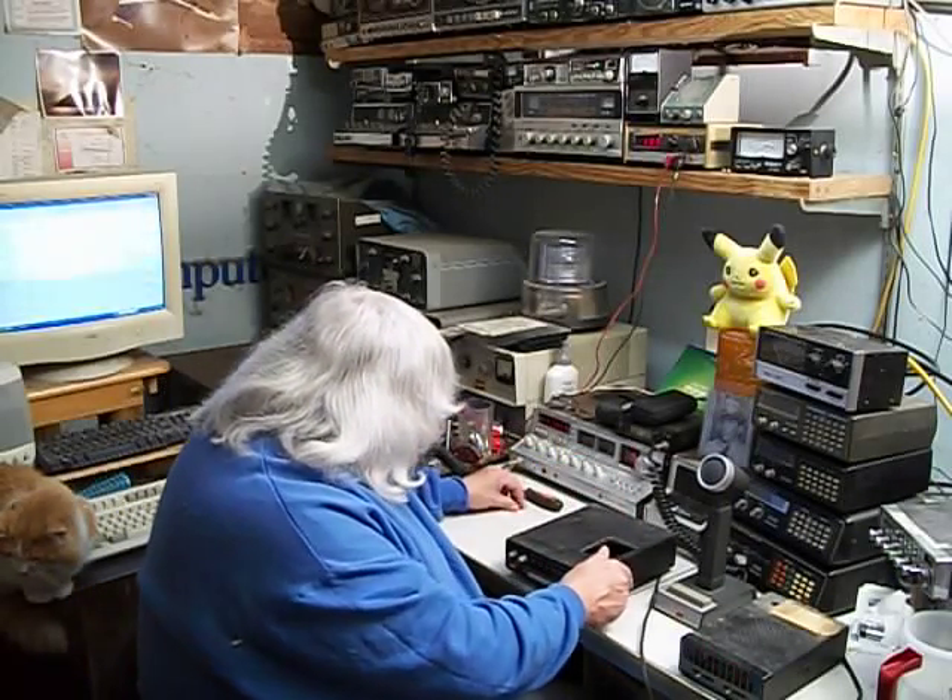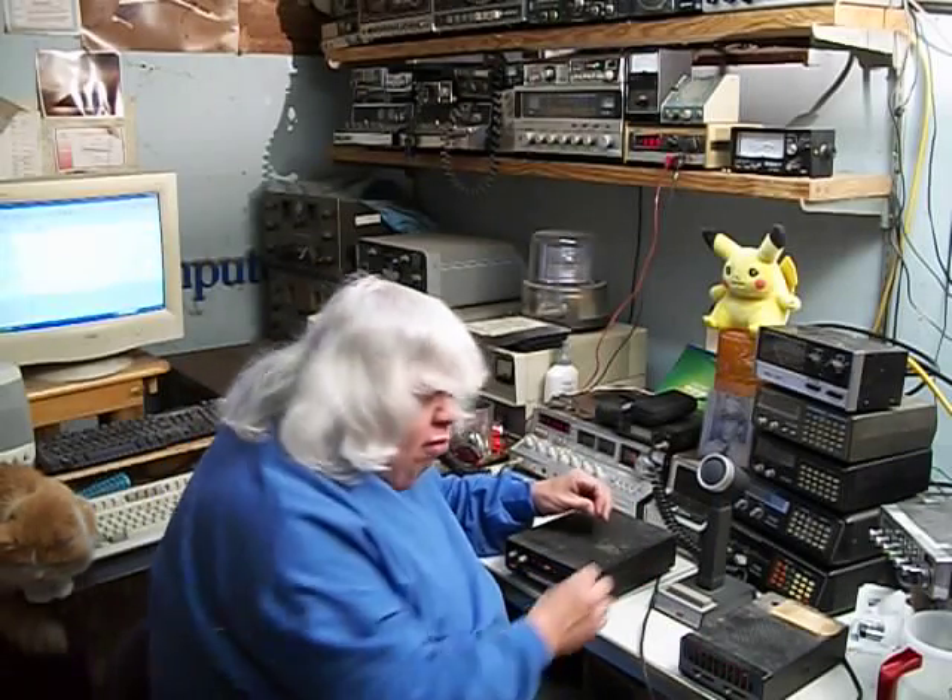I have a very healthy respect for all voltages — all the way from a half a volt upward. When I was about 18 years old I was hit with 45 kilovolts. Fortunately there was hardly any amperage at all. I was working on a Motorola television that had big glowing tubes in it. I had a screwdriver in my hand and as I was probing, my finger was on the shaft of the screwdriver. I got too close to what's called a 3B28 high-voltage rectifier tube.